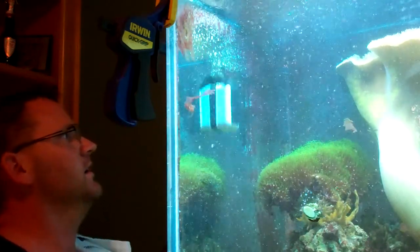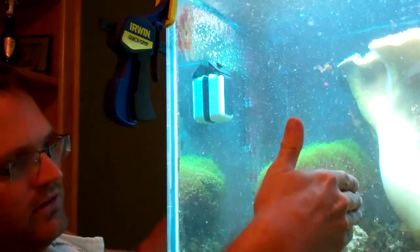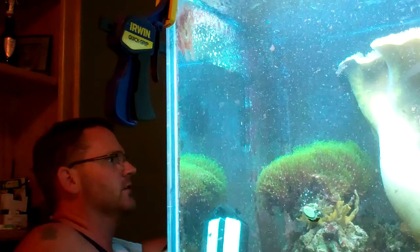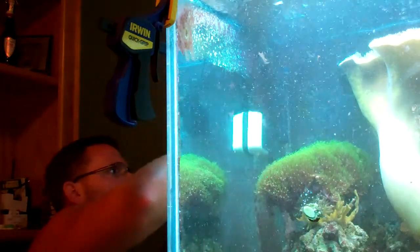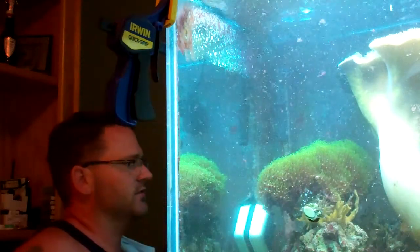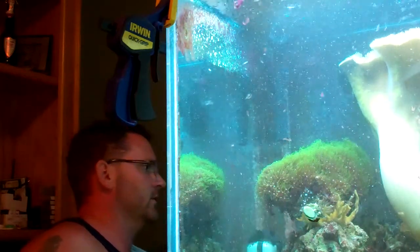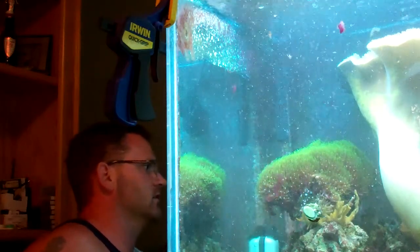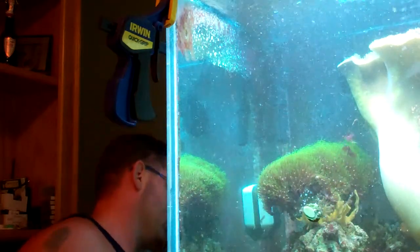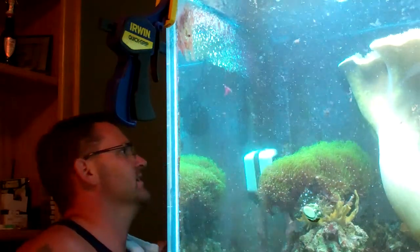And what happened was, the floor goes like this. So right about here in the tank is a jack post, and it goes a quarter inch down the floor on either side. So I was too concentrated on the stand being in contact with the floor, level and nice, than I was with the tank being in contact with the stand. And the tank was actually floating on all four corners, so it was not being supported by the corners, which is actually what you're supposed to do, support the tank by the corners. If it's 4 feet long, you can support it 6 inches from each corner and get away with it. And I did the opposite. So, learned that the hard way.